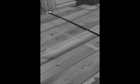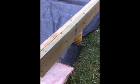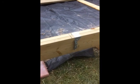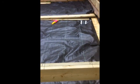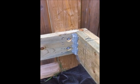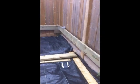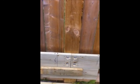We've got our outer box on now and the first beam on the front built. We used two by ten stock on the front, nailed every 16 inches along the beam for strength. The landscape cloth is in place underneath — that will stop any vegetation growth. In the corner you can see the two by ten galvanized joist hangers, bolted into the six by six and glued. It's bolted along the back side of the box and into the six by six with carriage bolts.